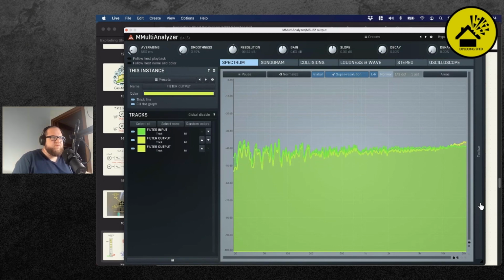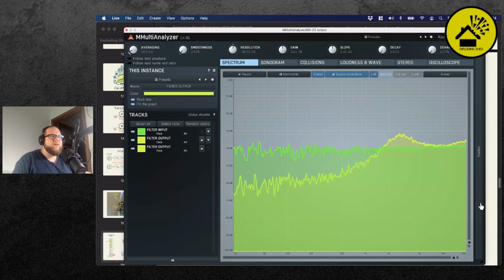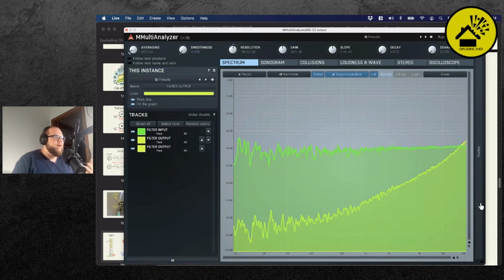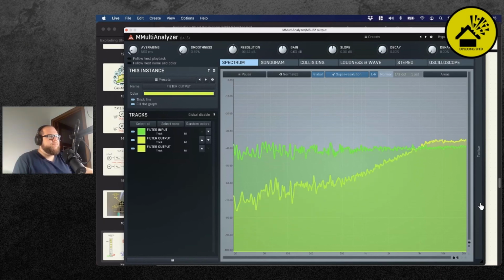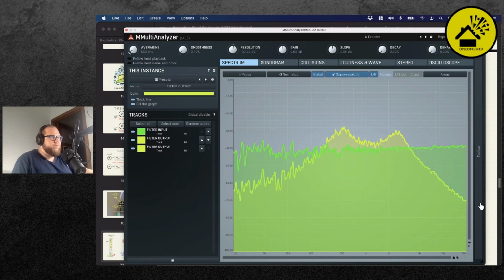So now I'm going to move the high pass filter. Note that on the bottom, you don't see the resonance peak that much. And now the peak is moving upwards. And now I'm reaching the edge of the physical range of my knob. And you hear that the noise is at the edge of your hearing. Also interesting to note, and now I'm going to close the low pass a bit, high pass, and you see now I've created a band pass, but the filters are not linked yet. And so I'm going to change that.